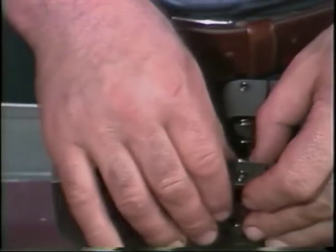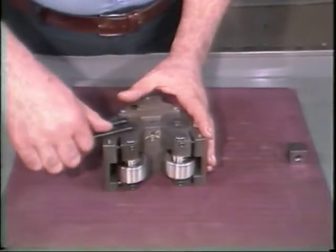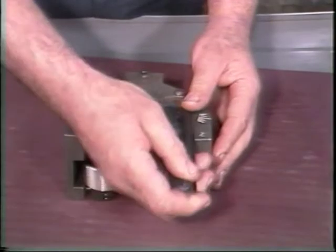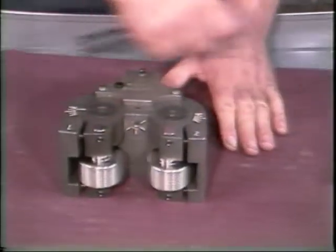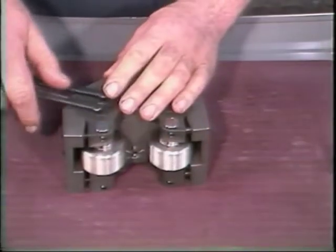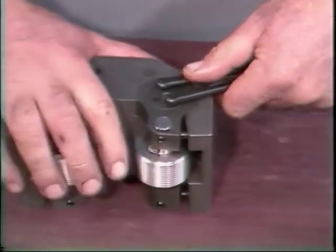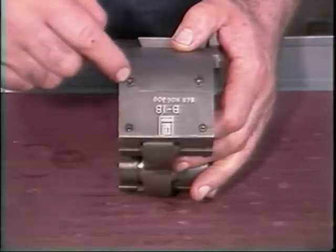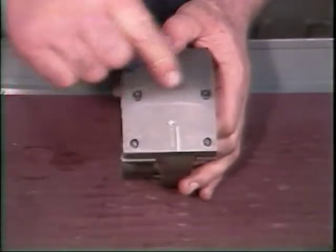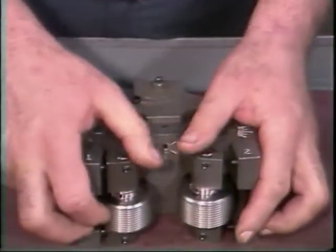Position the D roll in the number two arm in the same manner. The bench adjustment begins by loosening all four pivot stud nuts. This will allow you to move the arms to set the correct dimension. You must back off these eight set screws on the top and bottom of the head before you can proceed.